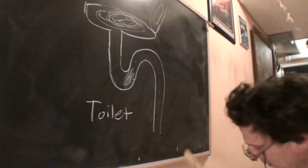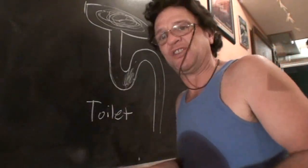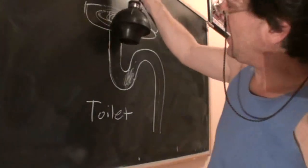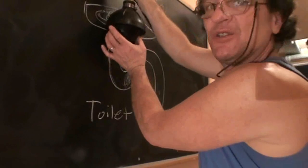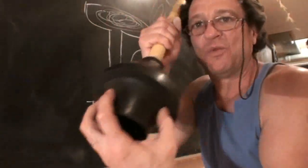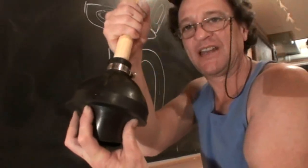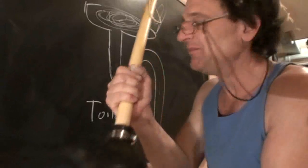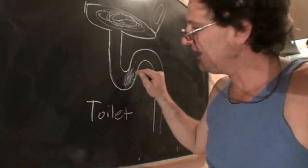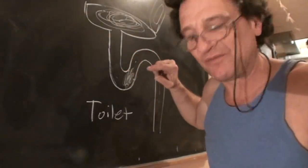So when you get in there with a toilet plunger, which we talked about, has the toilet shape, you don't have to worry about vents or anything like that. But you have to get in there at the bottom and make sure that the angle that you're holding the plunger gets the best seal possible on the base inside that toilet, and vigorously plunge to dislodge that clog that's usually going to be in the U-shape inside the porcelain of the toilet.